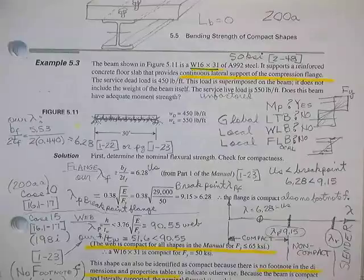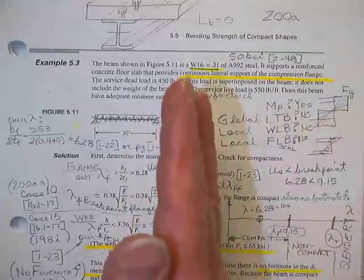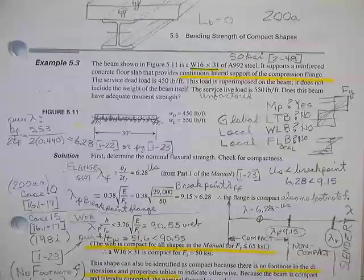That's a nice break. Stevens, since the web can buckle, and I guess that means the flange could locally buckle, both local bucklings, what else could go wrong with this beam? It could fail. How? And don't pick one of the two that we just picked. I'll give you a hint. It could fall over. That's right. It could laterally, torsionally buckle.